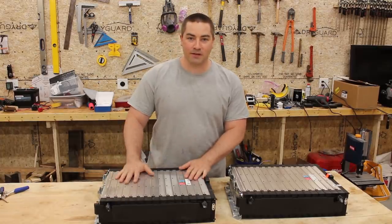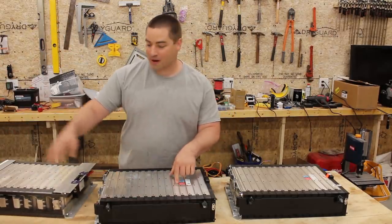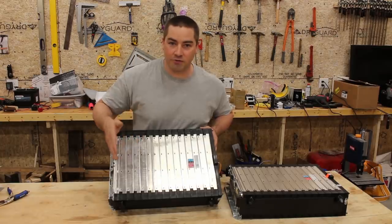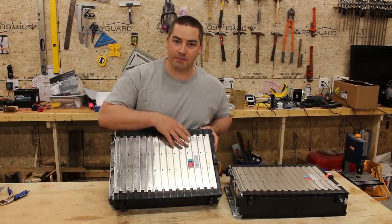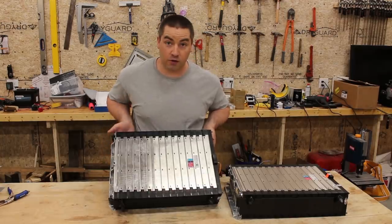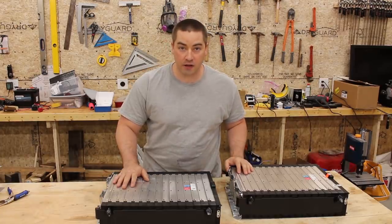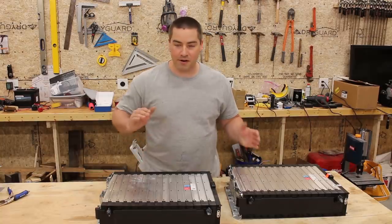These are LG modules and I actually built a battery pack with the same modules — I used them to build a 48-volt battery pack in a couple of previous videos and it works great. Now, this is how the modules originally came: a 3P10S configuration, meaning three individual cells in parallel and ten cells in series. So this is a 36-volt nominal pack, with a charging voltage of 42 volts. We're probably going to get some additional speed but also increased runtime.